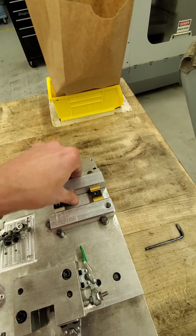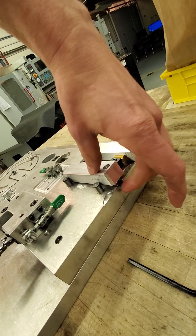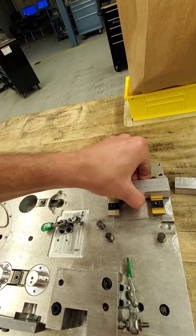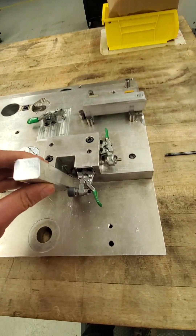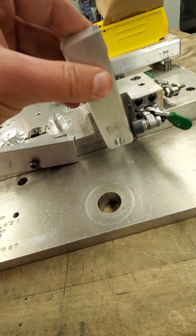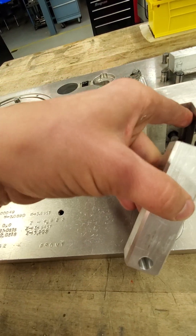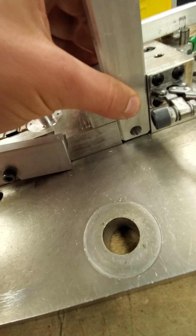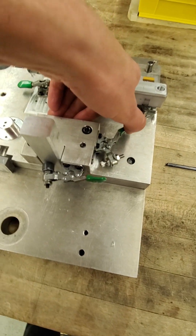This sometimes takes a little bit of persuasion to get out. Sometimes you have to take this one out first. There's a position here where you can stick your finger under, but be careful — there is a burr there to watch out for. We'll take that out and then this one is a little bit easier. Position two is going to go here to position three. There is a pin down here that's going to go through this hole in the bearing support. Undo this side clamp — there's a pin right here that locates this horizontally — put it onto that pin, lock this one down, you should hear a click, and then lock the side one down.